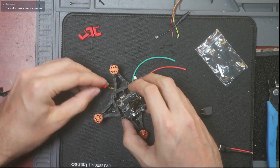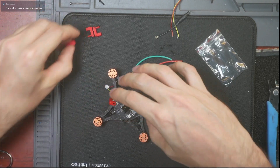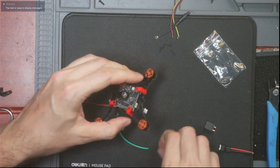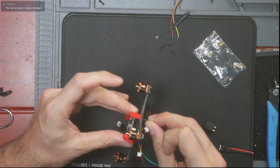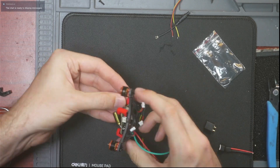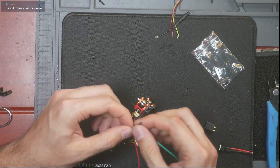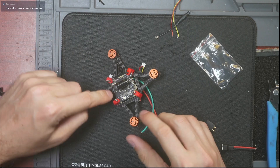Put the board down in there and take the little stack screw holders and stick them on just like that. What these struts do is provide a strong connection with the stack screws without compressing the gummies too much, so the PLA takes on some of that compression force but still provides the rigidity you want. That way your board isn't taking a lot of damage from crashes and vibrations. Also, if you compress the gummies too much it'll actually lessen their ability to dampen vibrations.